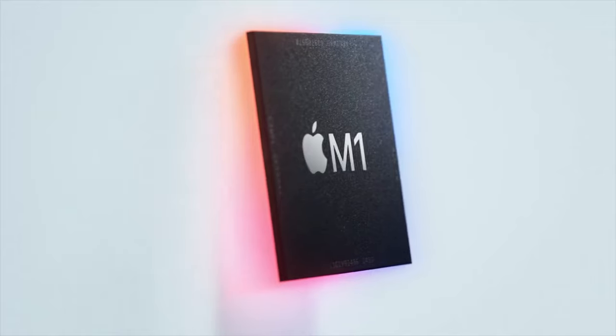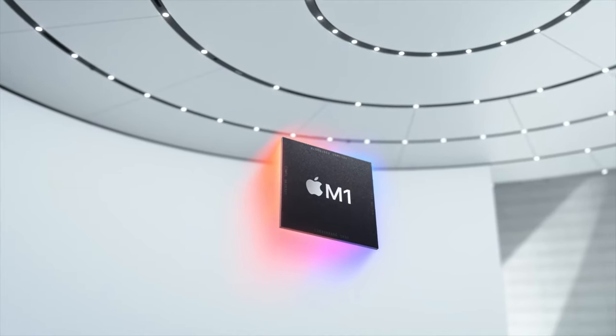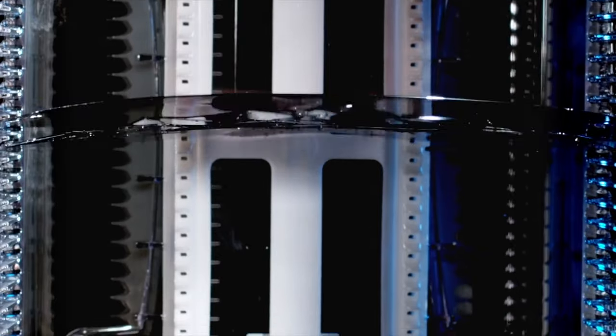The only difference is that Apple is marketing these chips a little differently from other companies. Remember at the start of the video when I said that your Core i5 is actually a Core i9, kind of? Well, that is Intel's method of marketing around the binning process. They name each tier of their chips, even though they may have all started on the exact same wafer. So your Core i5 may have started life on a wafer of i9s, but due to unstable cores, it may not have met the requirements for the i9. Does this mean it's defective? No — it just means that the stable cores you're left with get to live life as a Core i5 instead of being forced to run as an extremely unstable or defective Core i9.